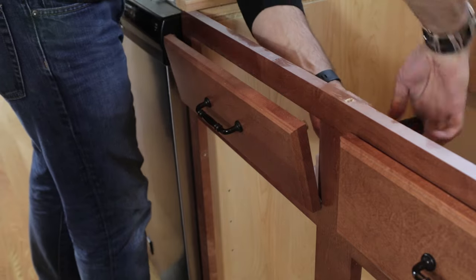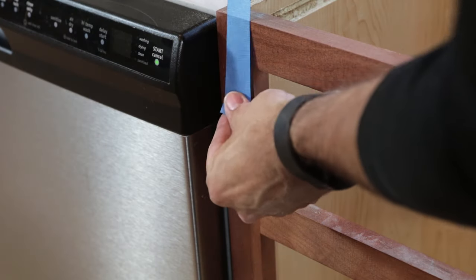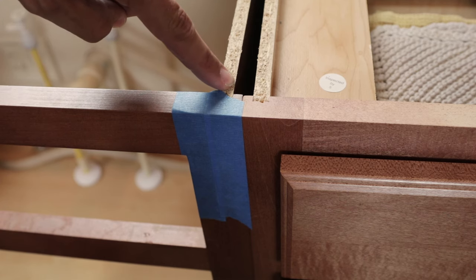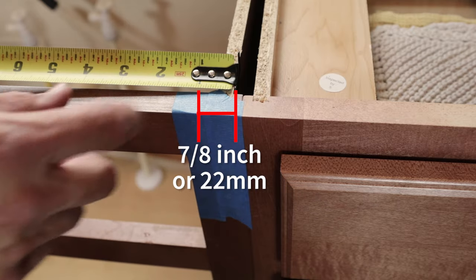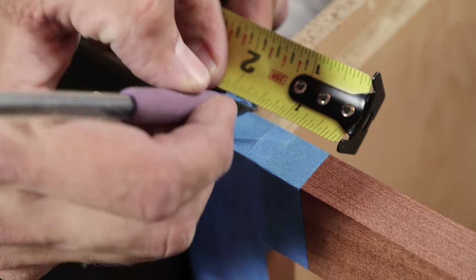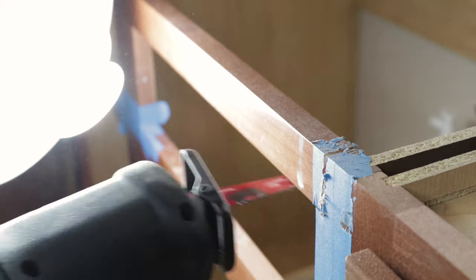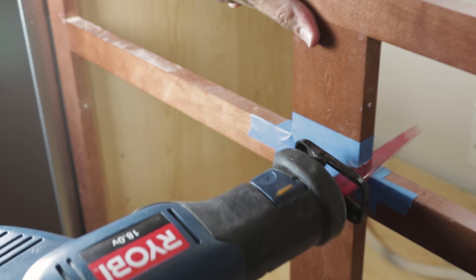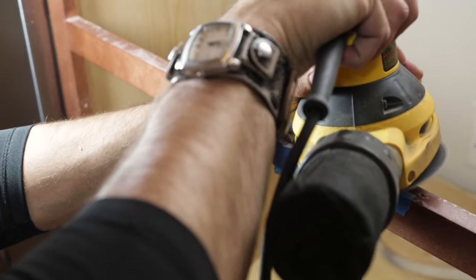Remove the cabinet doors and false fronts on the sink cabinets — be careful not to mar the finish. To protect the finish of the cabinet when cutting, apply painter's tape to the cabinet where each cut will be made and use this surface when marking measurements. For the first measurement, make sure you are measuring from the outside of the cabinet wall, not the front of the cabinet. Measure 7/8 of an inch or 22 millimeters from the outside wall and mark the tape — a square is helpful for marking straight lines. Do the same for the opposite side. Cut along the marked line until your cut extends slightly below the front rail of the cabinet, then follow along the bottom edge of the rail and cut towards the outside of the cabinet until you intersect with your first cut. Repeat for the other side. If your cabinet has a center support, cut along the bottom edge of the opening and remove and discard the rail. If your cut is uneven, you may want to sand it flush.